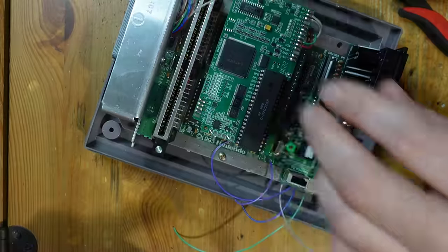As you can see and hear, everything looks really sharp and crisp, and it's looking perfect. Now if I hold select and start and then toggle through with left and right, I can actually change the palettes. Let me pause, and then if I go left and right like this, you can see I go through all the different palettes. If I hold the right button down and select and start, it brings me back to the default. If I hold left, select, and start, I can turn off the NES RGB altogether, like this. Then if I hold right, select, and start, it comes back on. Finally, to reset, you just hit select, start, A, and B, and I'm back to my main menu on my flash cartridge.